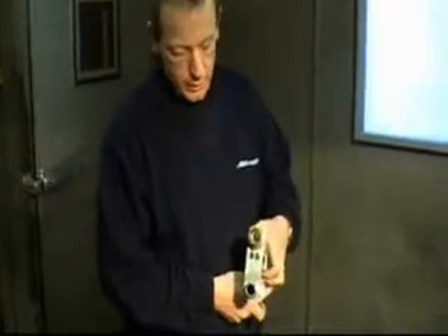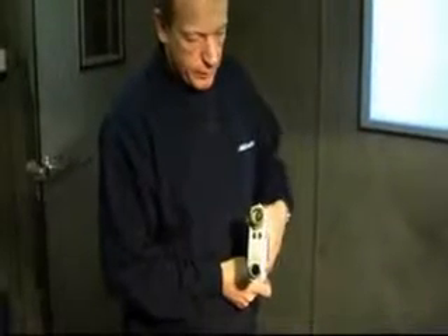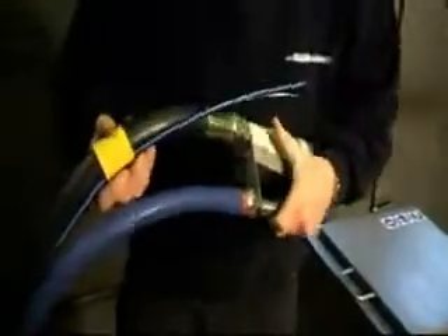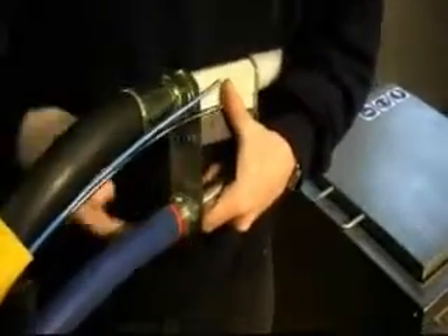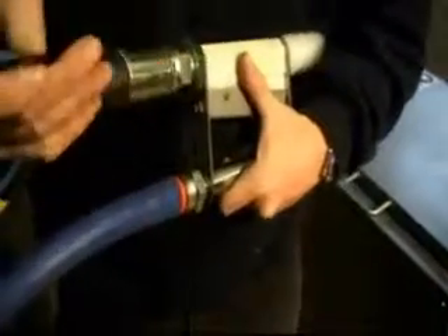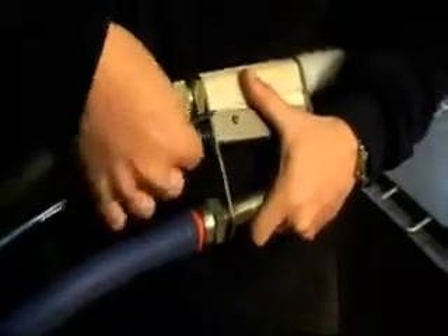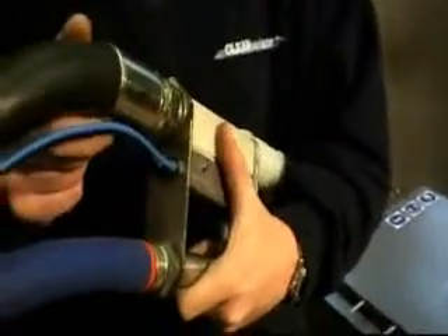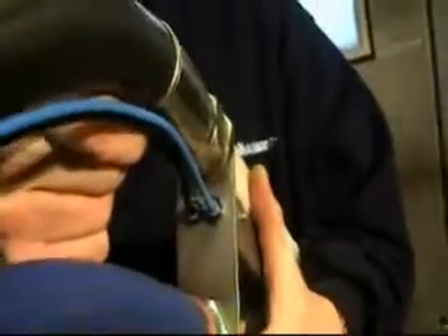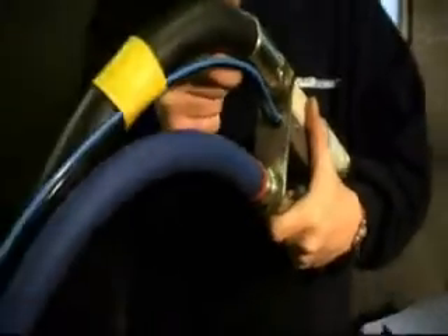This also emphasises the point of connecting all the hoses and carrying out the connection tests with the machine in the ice-only position on the selector switch. As you can see, these are now connected — ice tube at the bottom, air tube at the top. We take the trigger tubes: black one into the left hand side, blue one into the right hand side. Give each a quick tug to make sure that they are secure.